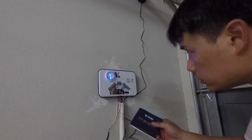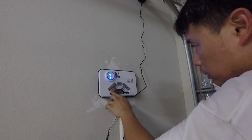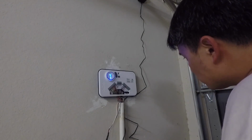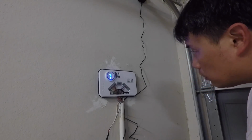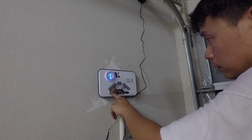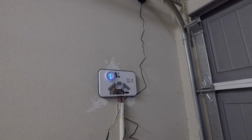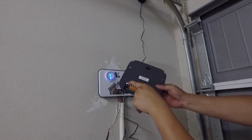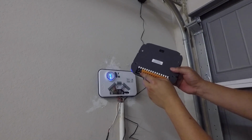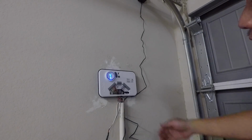So the only thing that's left to do is basically just test this to make sure that it works. I don't really see any reason for this not working other than this particular cable here, the common. So yeah, I was really disappointed when I tried to look for the Blossom manual, which is for my previous sprinklers. I couldn't find the label of what this connection was for. Basically, on the previous controller, the white cable was plugged into this black connector here, and underneath it, it says COM, C-O-M, which should mean common. So I'm assuming that should be good. We'll see.